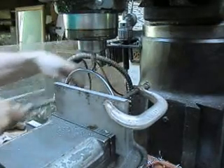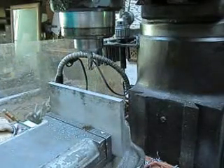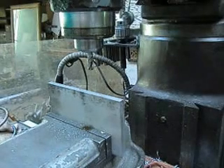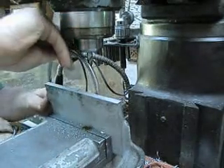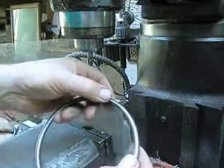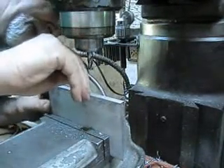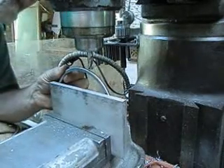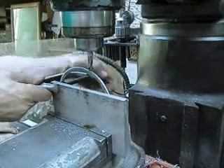Let's take this one out. I've got a little bit of a lump right here — I think I need to file that off. Get it flattened out just a little bit so that it's got a nice flat surface on that edge there. Drop my piece in, get it squared up, tighten her up, bring in the C-clamps, and crank those down.